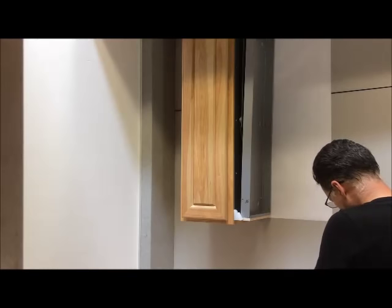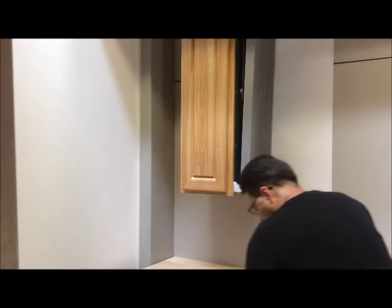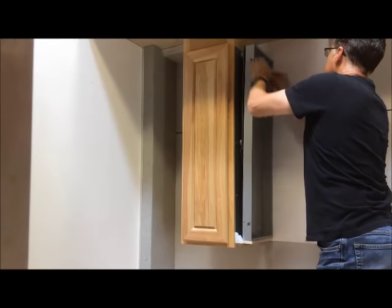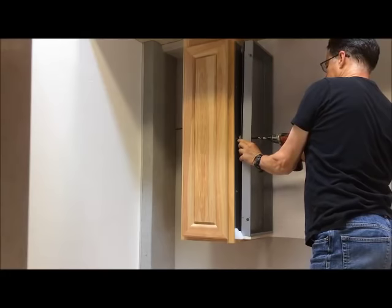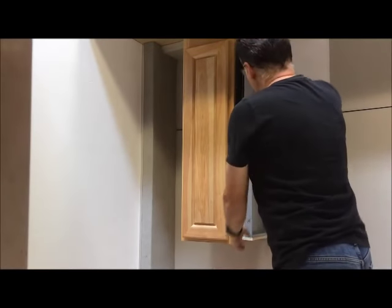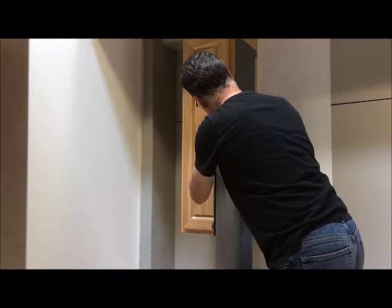Using the nylock nuts and your 3/8 socket, first start the nylocks. Tighten the nylocks. Now, if you bring the unit back down and set the thumb screw, it will make it easy for installing the rest of the parts.